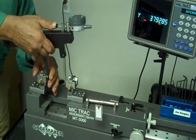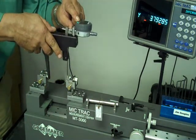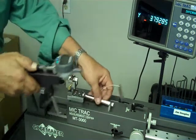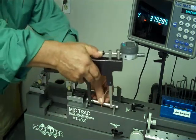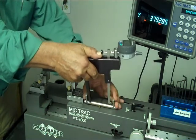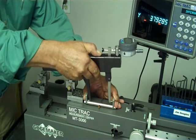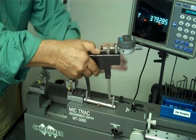The gauge would be set down between these two ears. This simulates a gauge block, and then I would zero. Or if I wanted to use the rod standard, I'd go down, set it in between, sweep left and right and up and down until I got my lowest reading, and then zero my gauge.